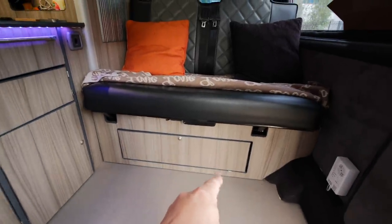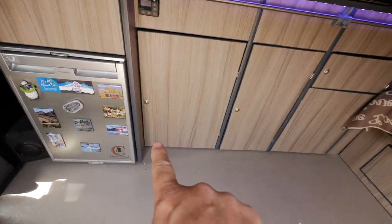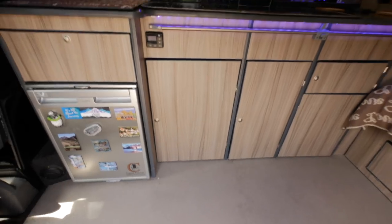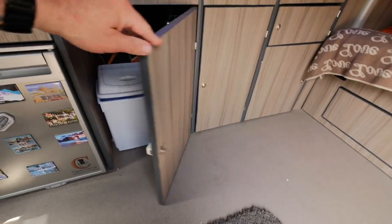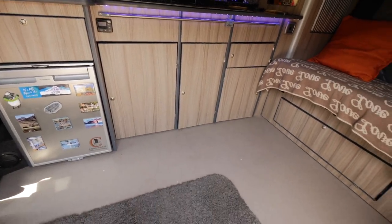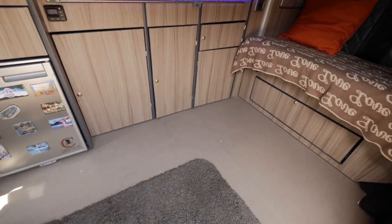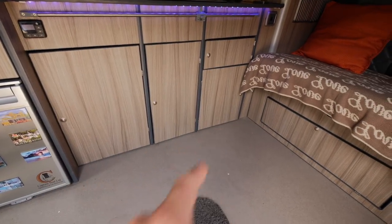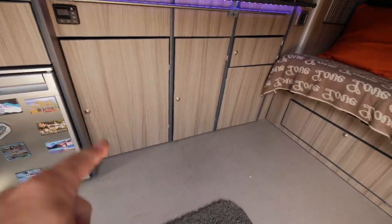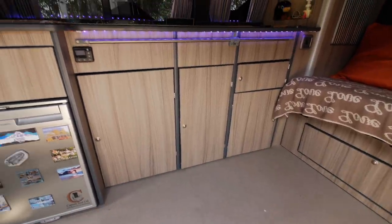I use the under-seat storage for my boots, sandals for the beach, and it's got a subwoofer on the other half. Something else I would definitely do different: those cupboards there - I'd have a plinth going across the bottom before the doors. The doors as they are just barely clear the floor. I'd wanted the option of a nice fitted carpet sometimes and being able to take it out, but I haven't got that choice with these doors. I've actually got some ply left so I'll cut the doors short, put a plinth across the bottom, and bring them up a bit.